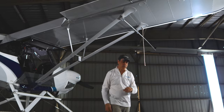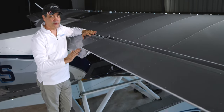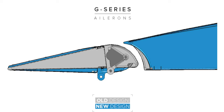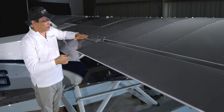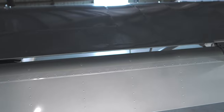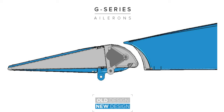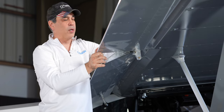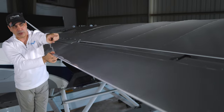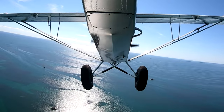Let's talk about the changes to the wings. They went to a G-series flap — more like a Fowler flap. We've got gap seals here, and these will slide out and can come down to 35 degrees. Then we've got the G-series ailerons as well. One big change in the X-Cub is that everything is push rods — no cables. You can see the actual push rod moving inside there.